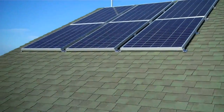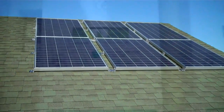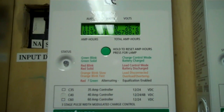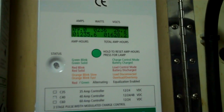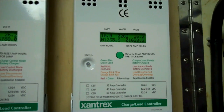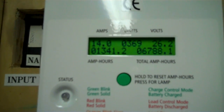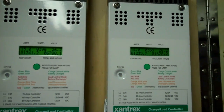The lower panels are the new ones. The upper panels are about four years old. I'll show you the differences in those two. It's about five o'clock in the afternoon. The upper array is putting out 290 roughly and the lower array is putting out 230. That kind of a spread isn't too bad. I've noticed this array will put out more in low light than this one, but this one will put out more than this one. I reset them both and this one's ahead by a hundred and something amp hours — it's not a big concern, but I'll monitor if it continues to fall behind.